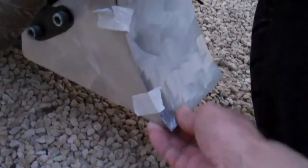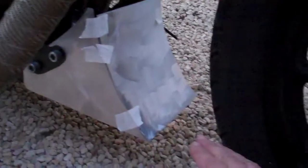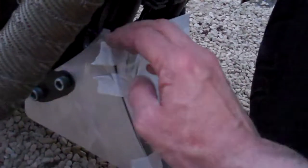Okay, moved on a bit now. What I've done is just lapped all the rest of the powder coat off it, just to get it into one finish. I've just stuck it together with some tape for now, just to show you the idea. That's now the right curve - it's a nice smooth curve, there's no ripples in it. When that's painted it will definitely show up if it's got a crease. So that's a nice curve. I had to trim this back up here - I had this idea of notching it round the frame, but whatever, just cut it across there, that's cool. May do something decorative with it because it's a bit of a block, but wait to see until we get it in primer.